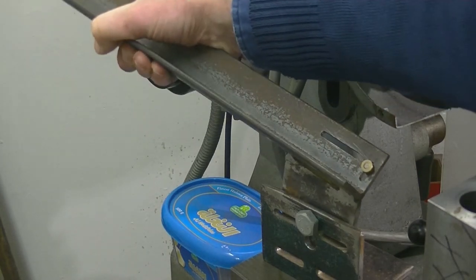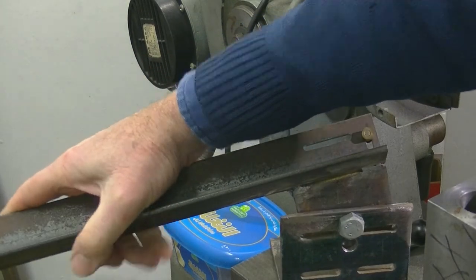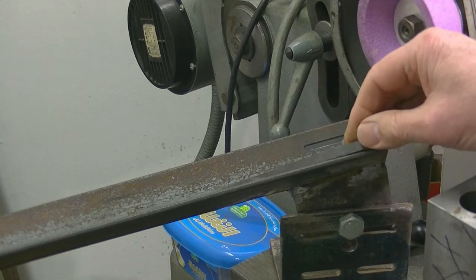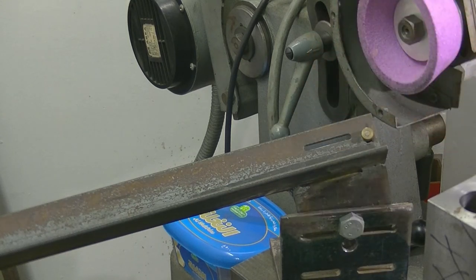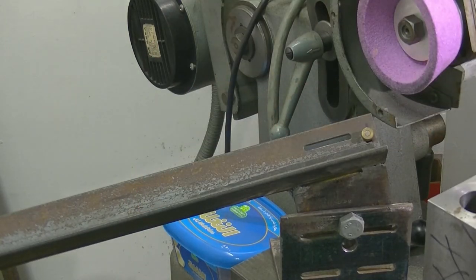It's adjustable for angle, and I usually use a clino with a little bubble level to get the angle. It's adjustable to get the edge angle on the drill using a well-proven concept called a protractor, so it's fairly easy to set up. For this particular job I'm using a bit of flat — a drill drift inside there — to give the squaring block a flat to locate into. If it located into the radius inside the angle, it wouldn't give you true repeatability as you rotated the squaring block over and over.